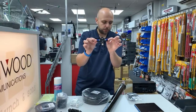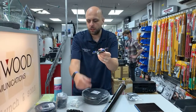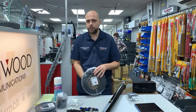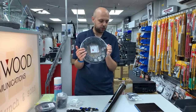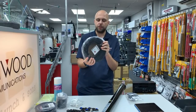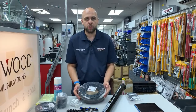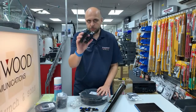With the dipole centres that we have available from stock — both with an SO239, or if you prefer, open wire feeder — so if you want to run a doublet, you could easily do so. We still have the Dipoflex in stock, available in 50 or 200-metre lengths. For a 50-metre length, you could easily make up a full-size dipole for 80 metres and have 10 metres left over. Dog bone at either end.